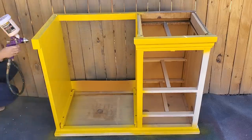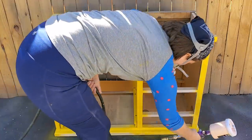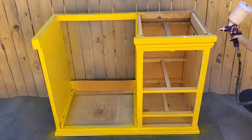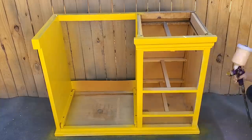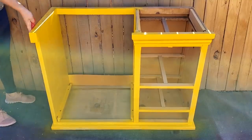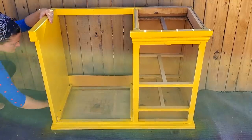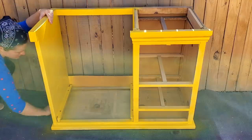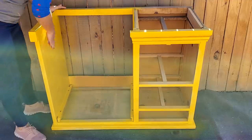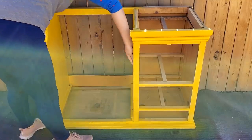I have learned that over the years — when I paint in the summertime I tend to get that really annoying rough texture that I have to go back and sand. And even watering it down, sometimes that can still happen, or you get a speck of dust in the paint finish. Whenever that does happen, you just go back over it with a piece of 220-grit sandpaper and just knock down any roughness. You're not looking to sand off the paint at all — just slide the sandpaper across the surface to take off any little bits that were sticking up.